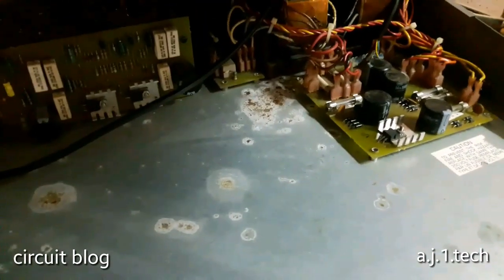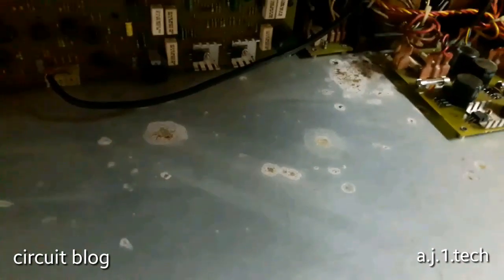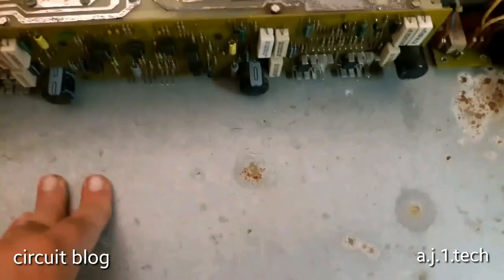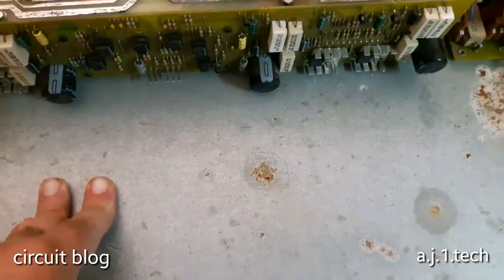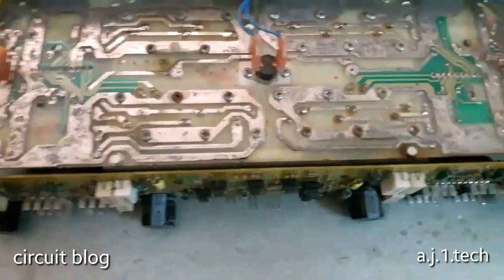Disconnect this jack and this jack over here from the power supply, and try to remove this control unit and see what happens. Sorry about that. This is the amplifier, as I believe. Where is the cooler on this thing? There is no cooler, as you can see, unless they use a separate cooler for each transistor, I don't know. There are coolers for the driver and the pre-drivers, and this board I believe is for the output transistors.